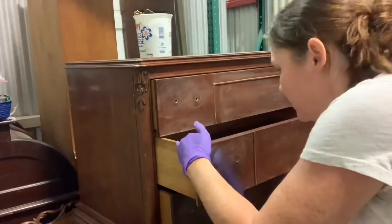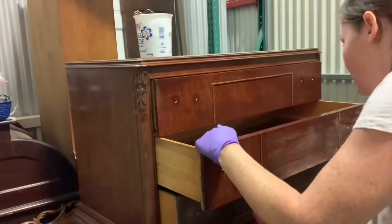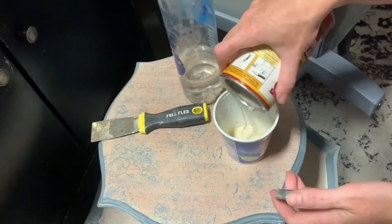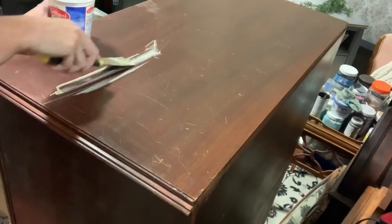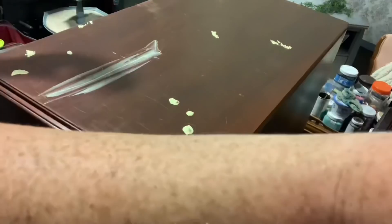This whole piece took me two sheets of sandpaper — that's it — just a scuff sand, with the exception of around the drawer frames to keep it from sticking. I'm just wiping back all the sanding dust after that. Then I'm going in with Durham's putty. This stuff is incredible — so inexpensive but man does it work, and it's become one of my fast favorites. This is going to fill in the deep scratch on the top, and any other scratches and gouges, because this thing has lived a life. All I'm doing is dropping it on with a spoon and then taking my scraper and wiping it back, because the less you have on there, the less you have to sand later.